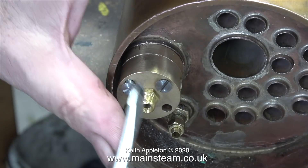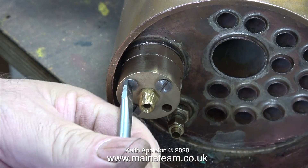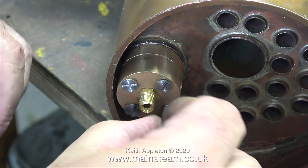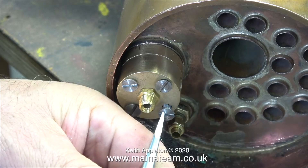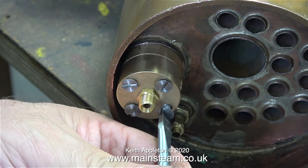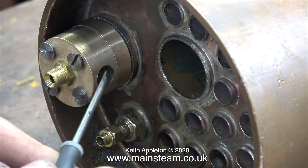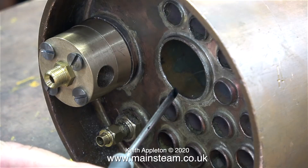When you see me running steam engines in the garden — just running them, not under load — I use all sorts of pieces of pipe to connect them together. This is just for convenience, but in real terms when you're piping something that's going to be doing work, especially a miniature locomotive, you need to make sure that you have plenty of steam available at the steam chests.